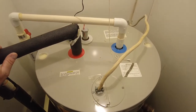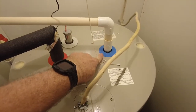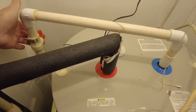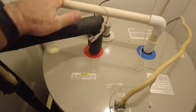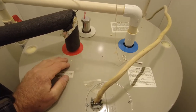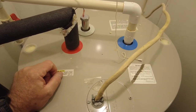This is the top of the water heater. You've got your cold water coming in to what's labeled the cold side, and your hot water that comes out going to your house. There's a shut off, and a lot of water heaters will have a shut off both on the hot and the cold. This is where the anode goes — a device that goes in the tank to keep hard water from corroding the inside of the steel tank.